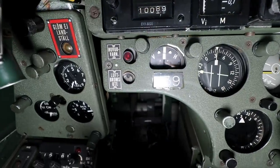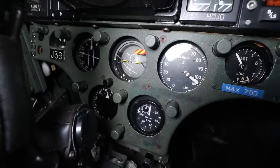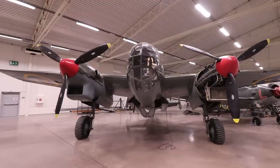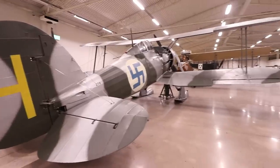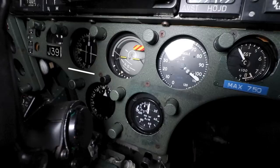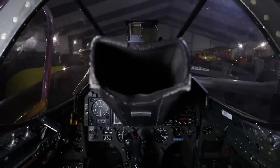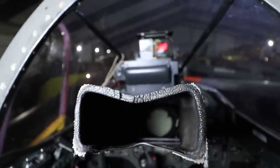A small turn indicator sits just below this. Behind the control stick we find some additional instrument gauges — some of the most important ones — though the placement is not great, with the stick obscuring them from some angles. Honestly, on my whole trip in Sweden I was very impressed with Swedish cockpit layouts, making this a rare but obvious negative example. Starting top-left: the heading indicator, followed by an attitude indicator and a dual-indicator fuel gauge. Below that a direction indicator and an engine RPM gauge, with the engine exhaust temperature indicator on the far right. Above all of this you'll find the radar scope.